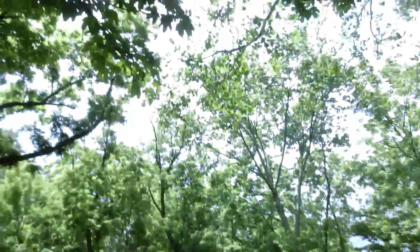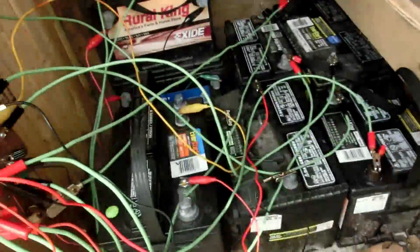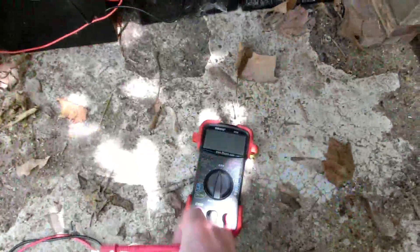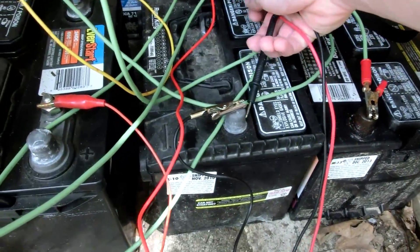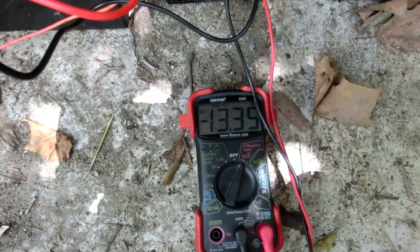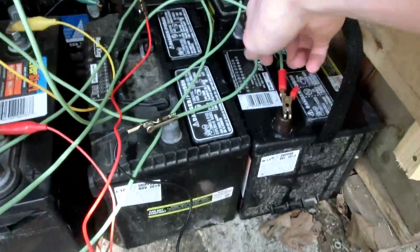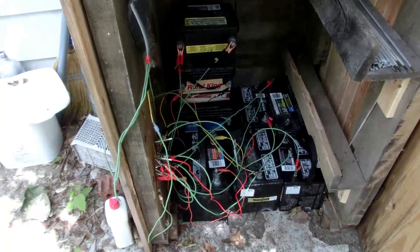I feel some rain coming in. It's so weird when you have direct sunlight and rain, but I guess we better hurry up. Now the big question is whether this meter is detecting only one of the batteries or if all the connections are working. To check, you want to measure the terminals on the batteries, not the connector itself. It reads 13.2 — the battery itself wouldn't stay at 13.2 on its own. It looks like all these batteries are connected up fine. If there's ever any battery not connected right, just jiggle the wire a little bit to clear off some rust.